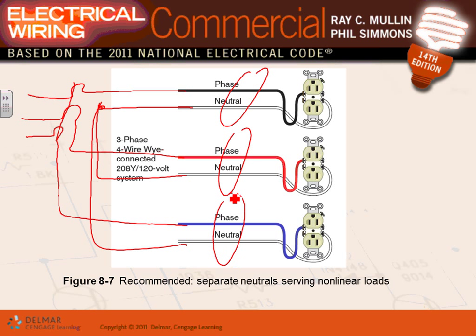And Adam, I think you asked me, if you read through the description of the project that we have, the technology receptacles that we have, it says pull a separate neutral with them on the branch circuit. I know these are not feeders, these are branch circuits. On the branch circuit, to minimize the problem of harmonics, instead of having a common neutral multi-wire branch circuit, the engineers specify a separate neutral with every circuit. Who cares? A separate neutral with every circuit will guarantee you that your neutral will not burn.